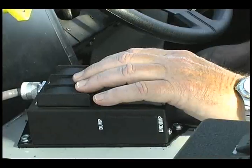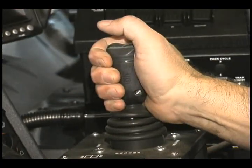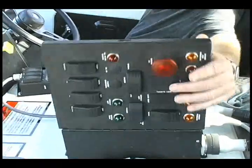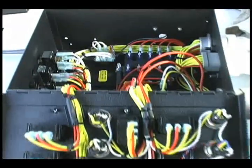The Hercules ASL is also easy to operate. Simple, easy click toggle switches or an ergonomic joystick operate the arm without the need for computers or a PLC. Instead, relay logic and proximity switches control all functions of the body. Your mechanics will really appreciate that.